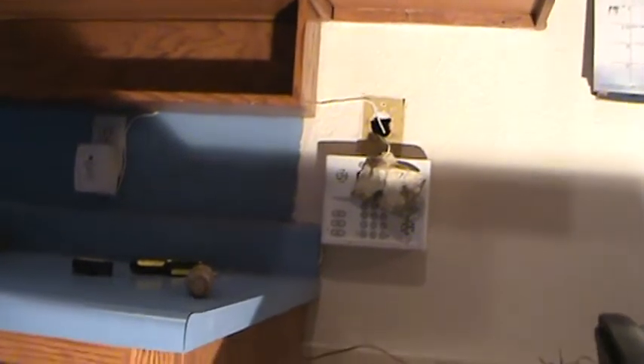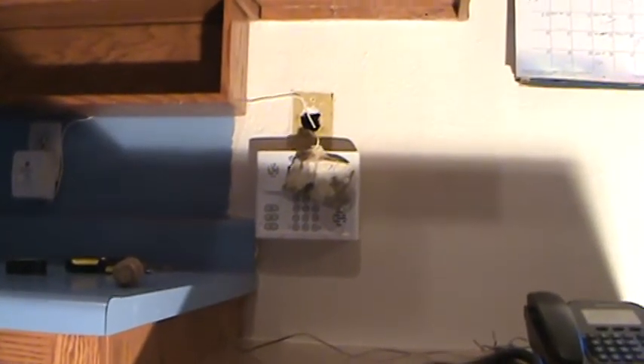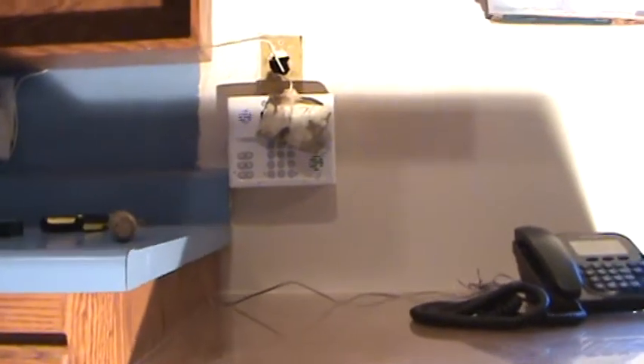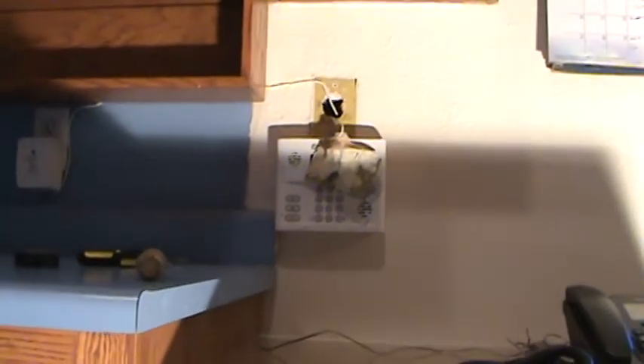Within that stud bay, if you've got eight or nine inches to the right before a stud, then from that stud over to the left you've got 16 inches. It doesn't have to be in the exact same spot as long as you're within that stud bay. If something's in your way you can slide it over within that same bay, because I know that wire goes straight down. When I installed that cut-in box I saw it and felt it - the wires were facing down. Once I cut that hole up there, the wire will be right there and I can drop this straight down.